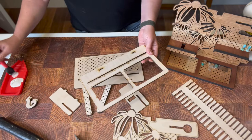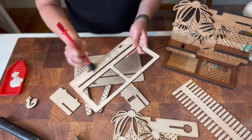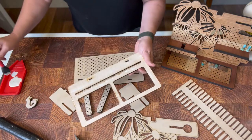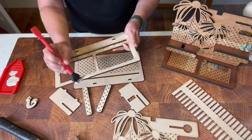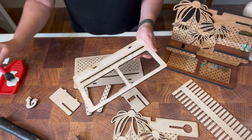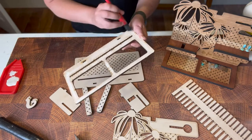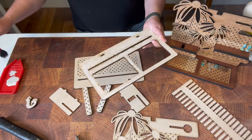I'm just going to add glue all the way around using my silicone brush. I love the brush in the tray because if I'm lazy and don't clean it right away I can just peel the glue right off — no harm, no foul. The other end acts as a scraper so I can clean up edges if the glue leaks out. If you wanted to use different woods or stain, I would do that first before gluing because it's easier and you don't have to try to get into nooks and crannies.